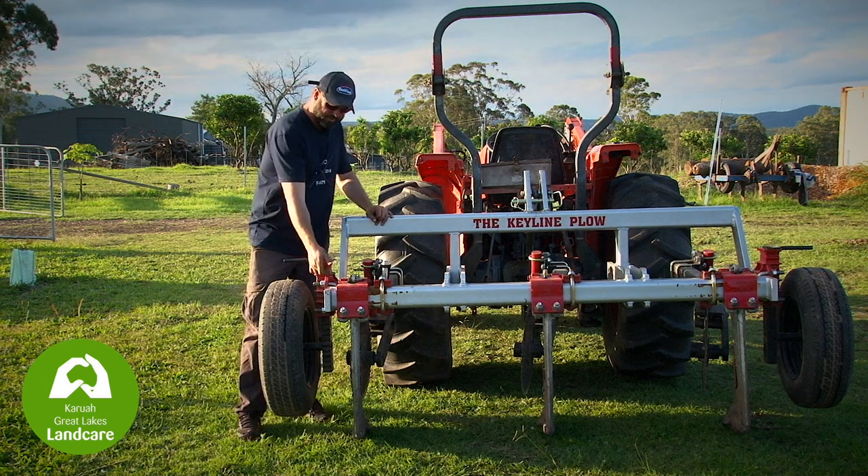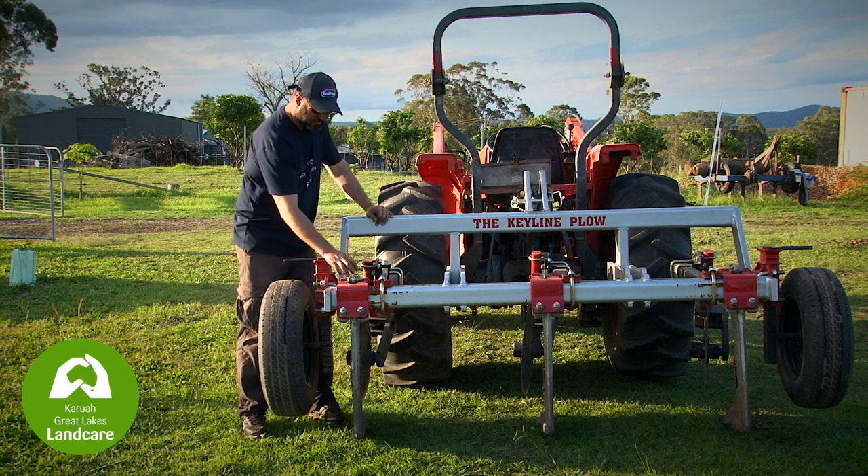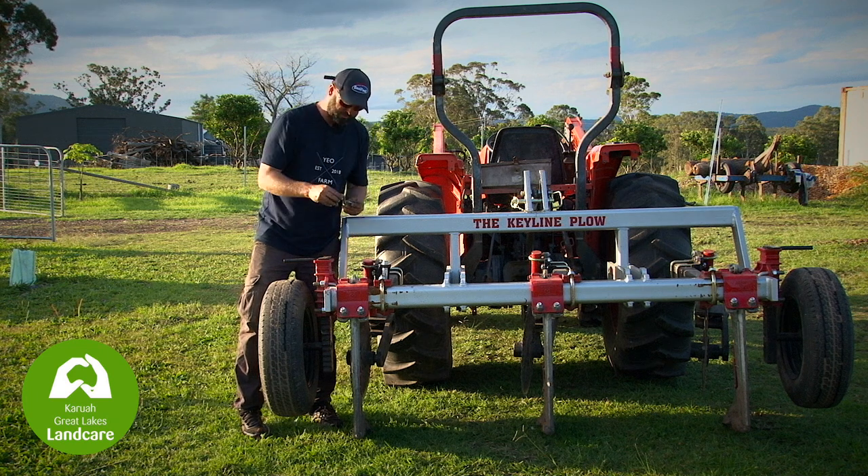Part of the plough design are these shear pins. They're designed as a weak point so they break before other components do. Also make sure you remove the shackles that were used in the tie-down process, as they'll be sheared if anything ever breaks through there.